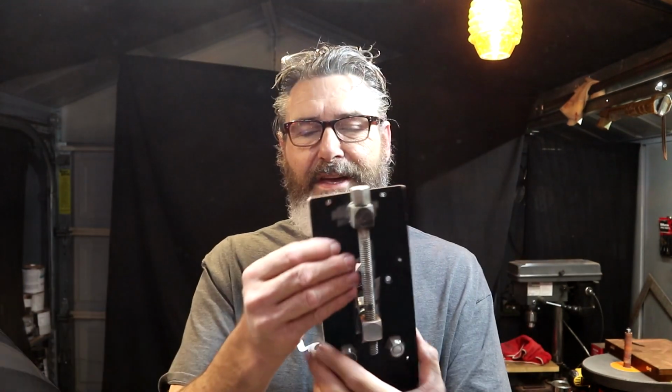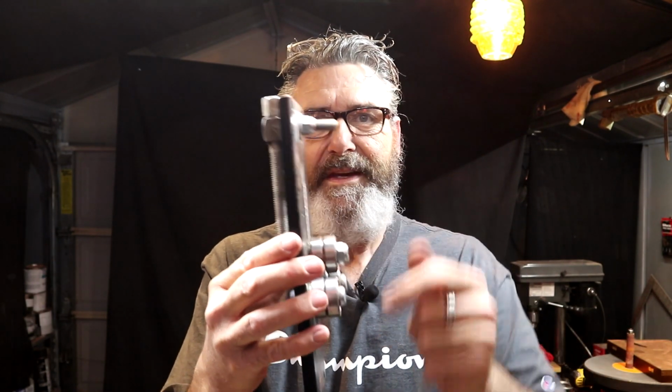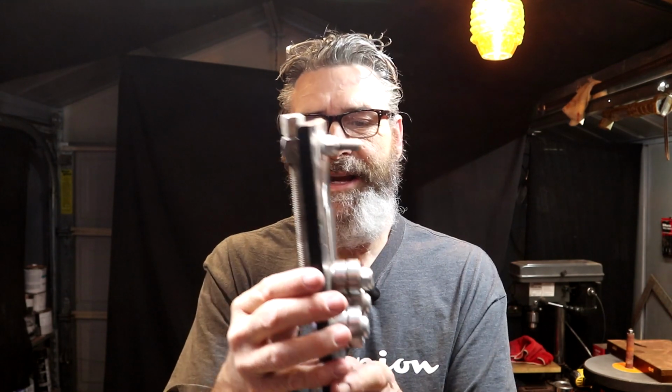I'm going to get set up to fret this neck. This is a piece of rack mount for a server. This is a serpentine belt tensioner off of like a 1982 Nissan truck, I believe it was. So when you screw this, it's a 17mm adjustment bolt. I welded that onto the head of a bolt. Did the same thing down here. Found a bolt that fit nicely in the center of these bearings.